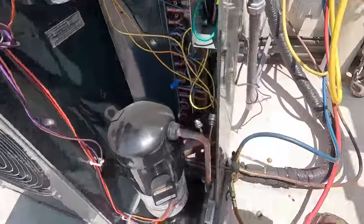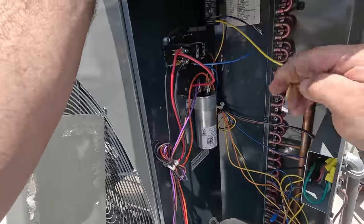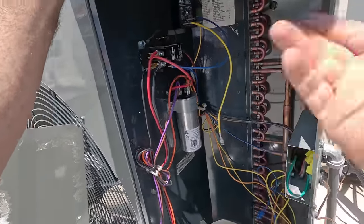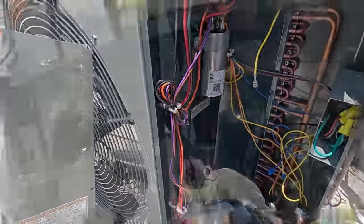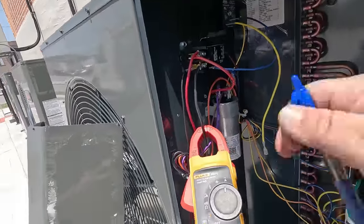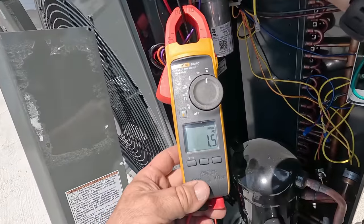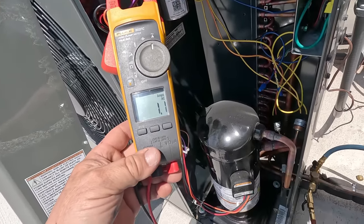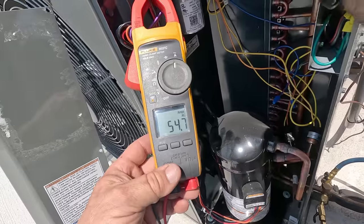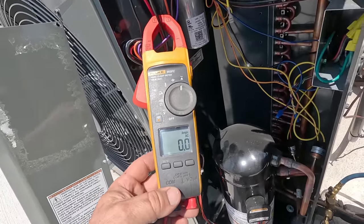Let's go ahead and flip this turkey on. Let's kill the low voltage so we can rapid cycle this thing. Low voltage is off, flip on the disconnect box, grab the amp meter, let's do some basic common sense. These are insulated pins here. Amperage 1.5 and she just runs and runs. I didn't like that - now it's stuck.